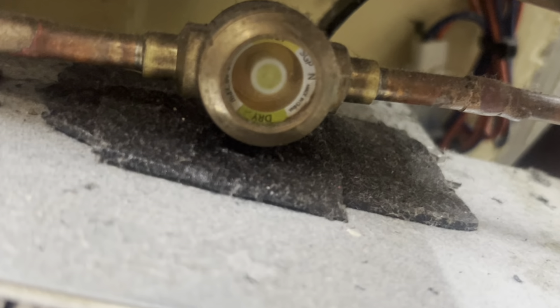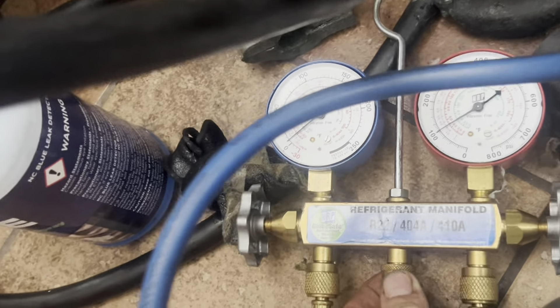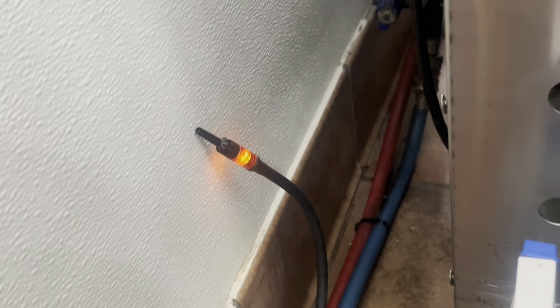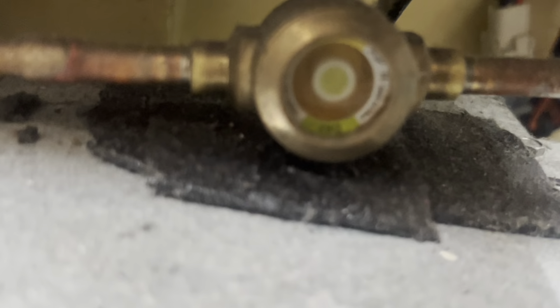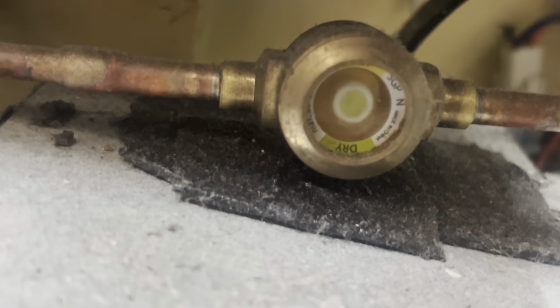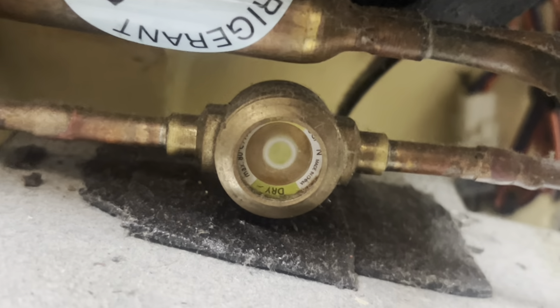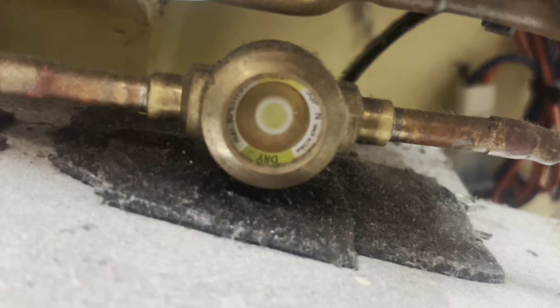All right, so our system is running. We are definitely out of gas — I think we're running 100 PSI and almost nothing on the low side. She's going to go off now and she's going to need some time to chill out. I'm going to bleed in a little of this. This is actually the customer's R-134a. This is a unique operator — he's got his EPA card, he can buy refrigerant. As much as I would love to sell them mine, I'm okay with this.